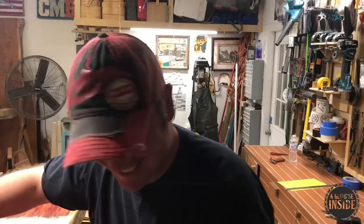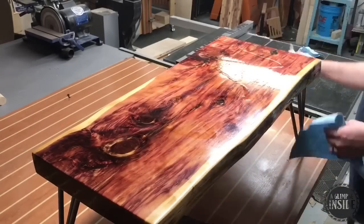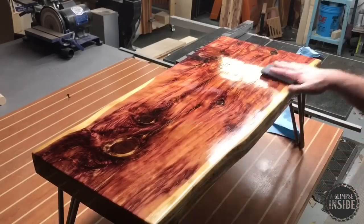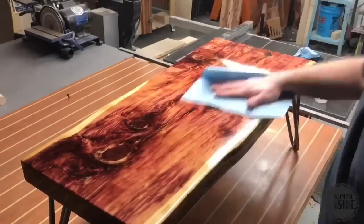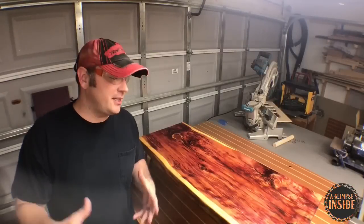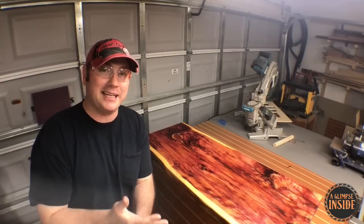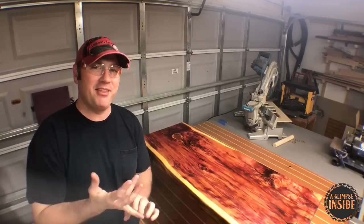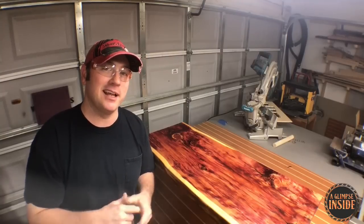It warms my heart that this little girl can spend time with me in the shop nowadays — it's such a cool moment. Okay, back to the finish. We're going to flood the surface with mineral spirits and take that 2000 grit sanding pad and lightly sand, adding a little more mineral spirits as needed, until you have an absolutely smooth surface. Now we have a glass-like consistency but it's a little hazy. After that last 2000 grit sanding with mineral spirits — I know it sounds crazy but it works — we're going to put one more coat of polyurethane on, thinned to 50% mineral spirits and 50% polyurethane, hand-rubbed on in a dust-free environment.